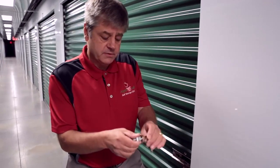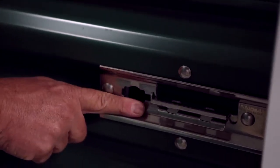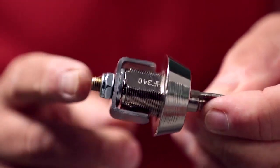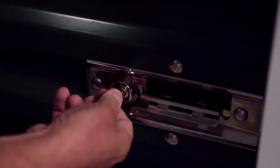There's an important detail with the cylinder lock going into the hole. The opening has an arched top and a flat bottom. Your cylinder has a threaded arched top and a smooth flat bottom. Grab the key at 6 o'clock with the flat bottom down, come over and insert it flat bottom down, push in hard, and turn the key up to 3 o'clock, then pull it out.